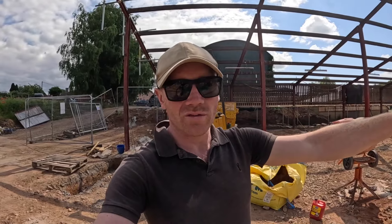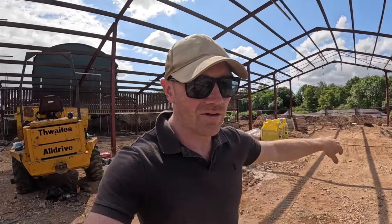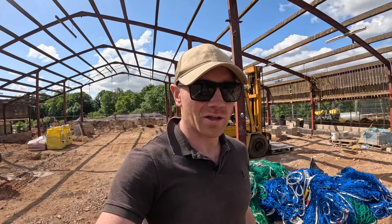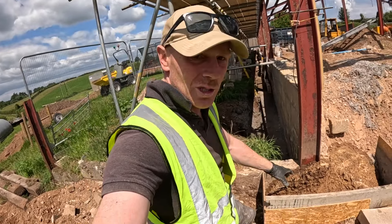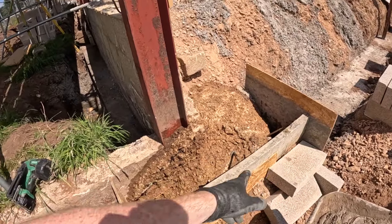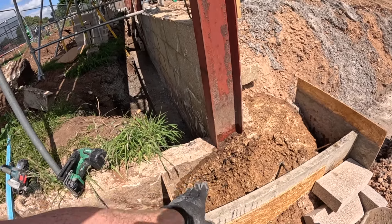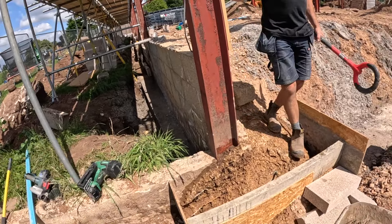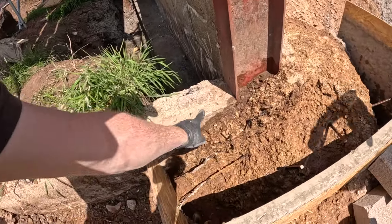The job now is to clear up the corner over there. Tom's having a bit of a dig around just to where this block work carries over the old footings. It's not necessarily always going to line up with the coursing. We shuttered it in, got a load of rebar stuck in there. There's some reinforced mesh that was already in this corner, so that's going to help tie it in, and then when we bring the block work around, that'll be tied into the old as well.